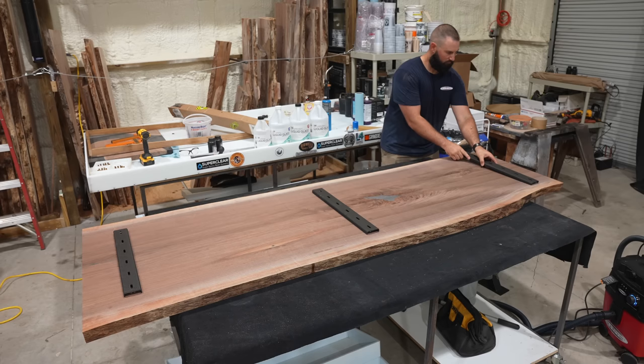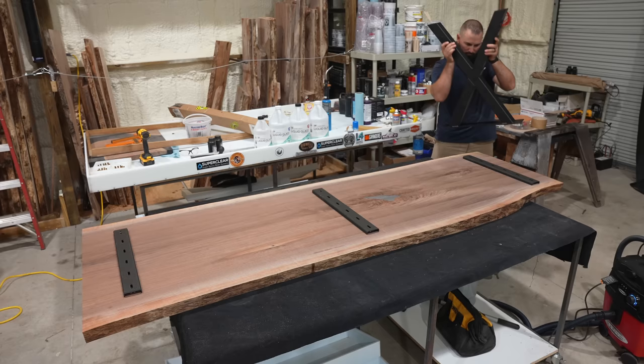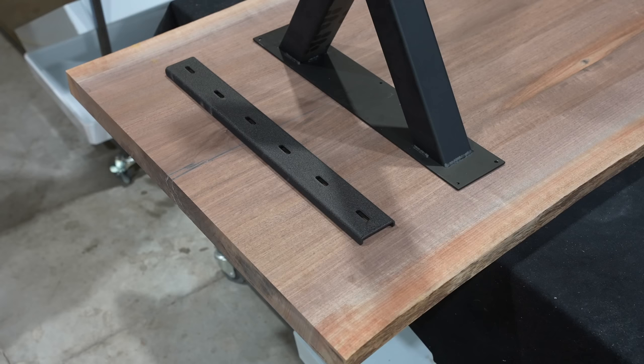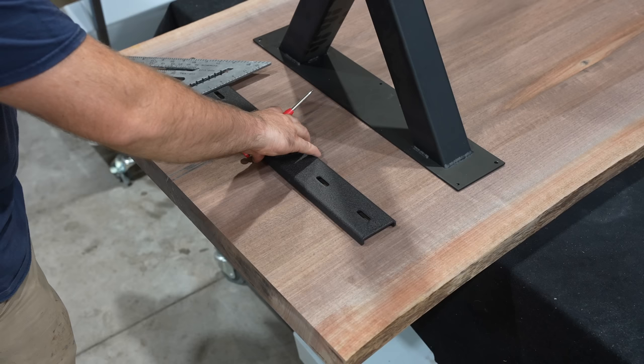For this table, I've decided that I'm going to use 3 C-channels, 2 on the ends and 1 in the middle, and this will ensure that the slab stays perfectly flat over its lifetime. I've laid out these X-style metal legs and I like the way it looks, so all that's left to do now is start putting my markings onto the slab